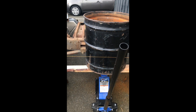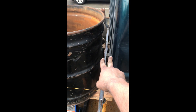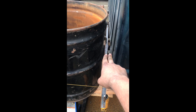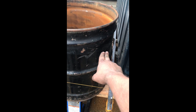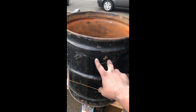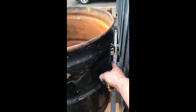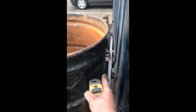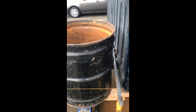Until I build the bed frame I won't know fore and aft exactly where the gasifier needs to sit. I need one inch between the cab and the bed rail, then two inches back will be the back edge of the bed rail, then a quarter inch of clearance to fit the gasifier — the same quarter inch all the way around so the bottom barrel is not touching anything. I have plenty of room and can move it back; I've got probably close to an inch before I get close to the spring hanger. I'm pretty sure I have it close to exactly where it's going to sit width-wise. If I need to move the bed a little more forward, I'll take it down to a three-quarter-inch gap — that's totally fine. That's a pretty darn good fit.